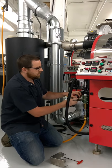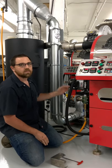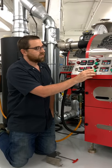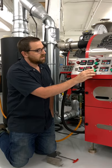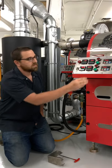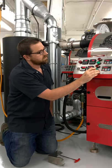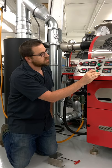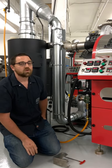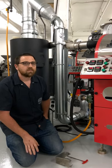When we're done with this, we re-seat and re-lock that silver disc, then press the button. Unlocking the clip is as easy as pressing that button in again. Now we do want to test this, so we'll start running down through this gas pressure to make sure that we have resolution. We'll start by going directly to the number, making sure that we don't have any changes. Stepping down another 1,000, we can see that gas pressure swiftly change to match. Continue this process until you're sure that you have control for the roast style you want to achieve, and call me if you have any questions. Thanks for watching.